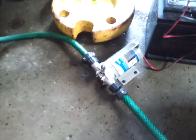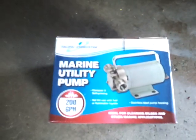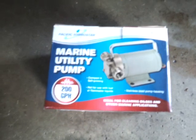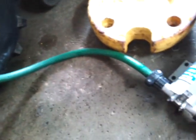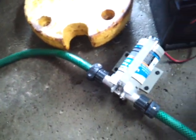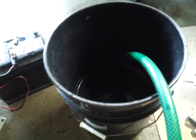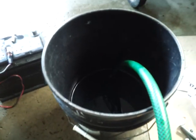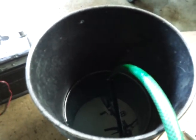To move the fluid we're using a Harbor Freight Marine Utility pump. I picked this up on sale for twenty-four dollars. Made up this small hose connection here with some scrap hose — I have a dollar ninety-nine in each of the fittings, so there's six dollars in the fittings. From what I've read online, each tire will hold five and a half gallons, so I've got a five-gallon bucket and this is a fifth gallon about to go in — just makes it easier.